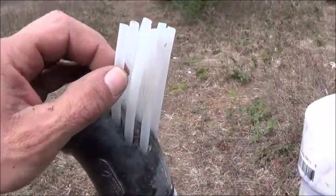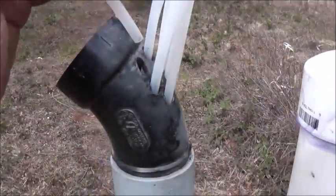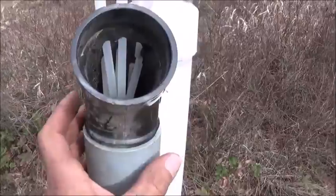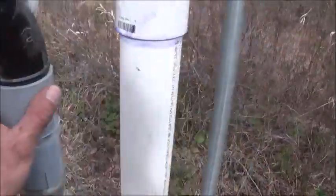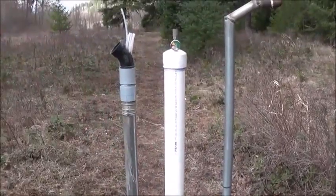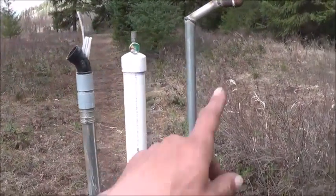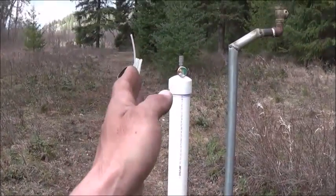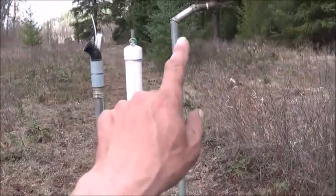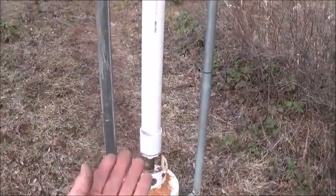I just wanted to show you this before gluing them all together. These clear tubes draw just enough air without taking up too much room to clog the pipe and restrict flow. You want to make sure there's enough water flow to exit the smaller pipe. I've got a larger pipe in than out, which allows for a large volume coming in from uphill to grab a lot of air. I didn't want to grab the air too far uphill because the water ram effect is going to stop that flow and could let air bubbles travel back up the stream. This length seems about perfect to generate flow, pull air into the system, get it down to the tank, and then slam the valve shut to jack that air into the upper cylinder.